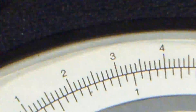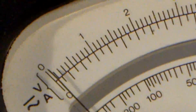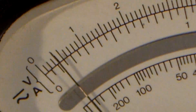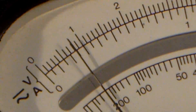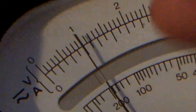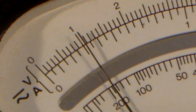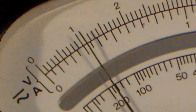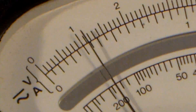I'm going to short it out again — I've just got a little crocodile clip, I'm just going to clip that across there, shorting the meter out. Now I'll disconnect that clip — 0.1, 0.2. So I couldn't adjust the power supply down at these low levels, because the cell — I don't know if it's acting like a capacitor or like a battery. That voltage is still climbing. I think with a normal capacitor you just short it out and that's it, the charge is largely gone.